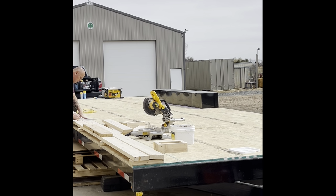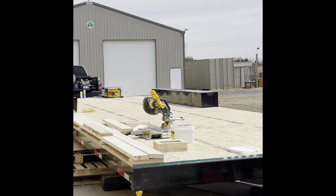But he also wants to make sure that you get the right amount of studs every 16 inches. So if you ever have to remodel, you know that there were studs there every 16 inches. There may be more, but you at least know that every 16 inches, you're going to find a stud.